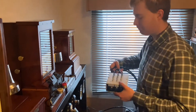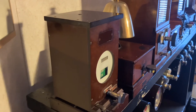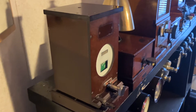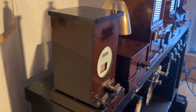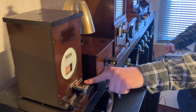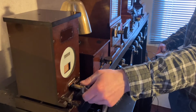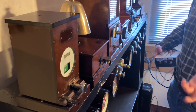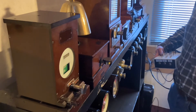We also have a lamp out unit. At the moment the lamp is lit and the pyrometer is happy — that's made contact. If the pyrometer was to go out, if it was to cool down because the flame's gone out, that would ring and it would be very loud and it would annoy the signaller. So the signaller would switch the indicator to the bell off position. The indicator circuit still works — it's still showing that the lamp is out — however we just silence the bell. When the lamp would be relit, we'd get that indication but no bell ring, unlike on the system. It's the signal's responsibility to put it back to normal and then test the system.